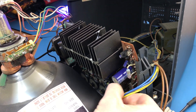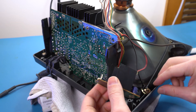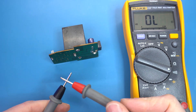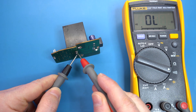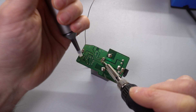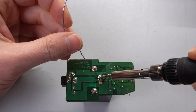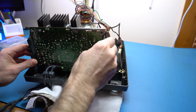Back inside, I'll finish disconnecting cables for better access to the board. The defective 12V regulator has its own little board, which makes sense because this was added as a second revision of this monitor. Let's take it out and have a look. There are no obvious burn spots, but checking continuity — two of the leads are shorted. Checking under the microscope, it just shows it's really destroyed, so I'm not surprised it wasn't working. Time to desolder it and put a new one. I'll use the old-fashioned solder sucker pump, add a new 7812, screw it in place, and solder it.